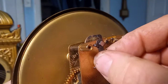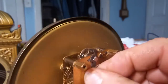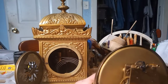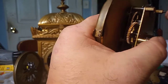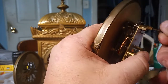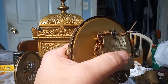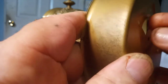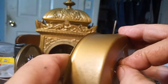This is the mechanism that speeds it up and slows it down, and that's what you open the access door for — to speed it up or slow it down. Now it's time to put these posts, screw them back in, and then put the movement back into the case. I also had to clean up the door to get the opening better — I wiped it off and lubricated it just a little bit so now it's opening and closing properly.